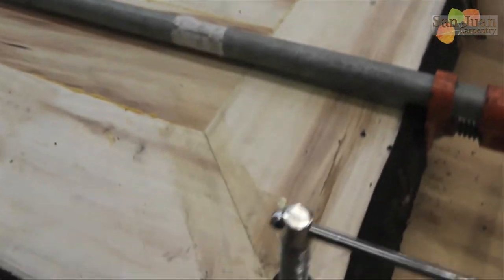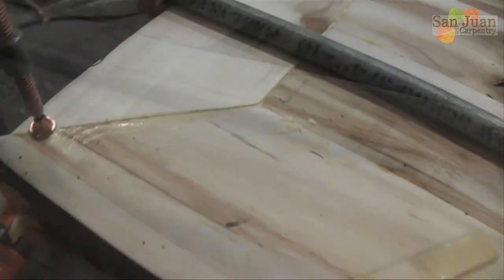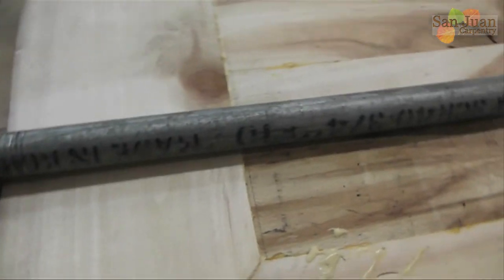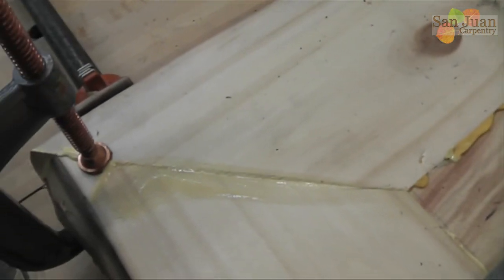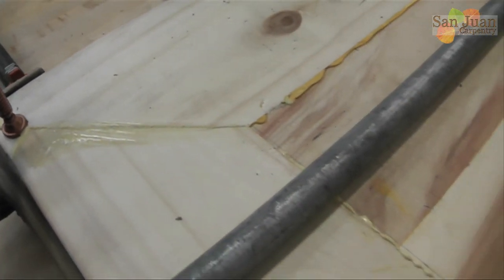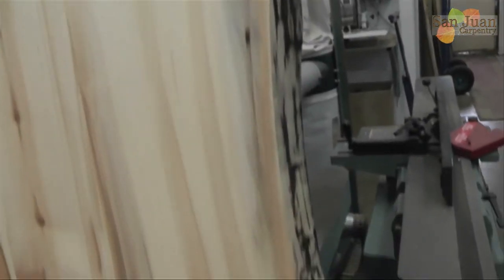As you can see, Chris's seams line up perfectly. This was accomplished because he used well-tuned equipment with premium blades, took his time on his cuts, and properly used his clamps to hold it all together. Next, it wouldn't hurt to run the tabletop through a wide belt sander if you have one available to you. Use a random orbital sander with a contouring pad to shape your corners and you've got an awesome live edge table or bar top.